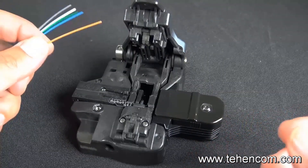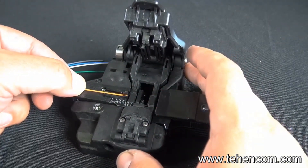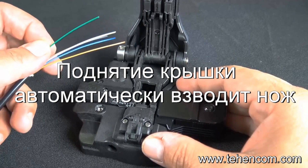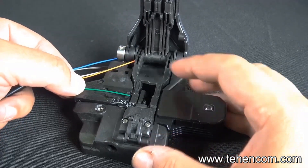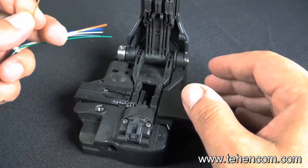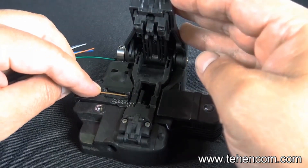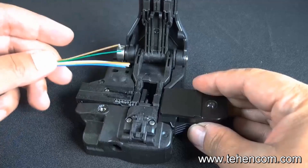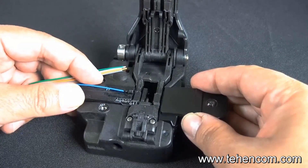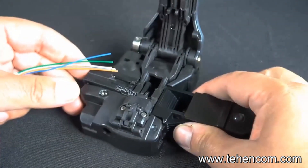It is designed for single cleave applications, and one of the things I like about user-friendly right here — as an example, if you have a six-strand fiber, all you have to do is put it in place at ten and a half, pull the top back all the way, prep the blade, cleave it, go to the next strand, push it down, cleave it, and so on and so forth. It was really easy. The old one, you'd have to move the tab and push the button each time. So if you have a lot of fibers to do — which obviously you probably do if you got the tool with 48,000 cleaves — this is definitely more user-friendly. Long term, it's gonna be fantastic if you've got a lot of these to do and you plan on expanding your business.